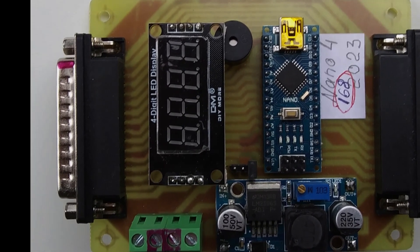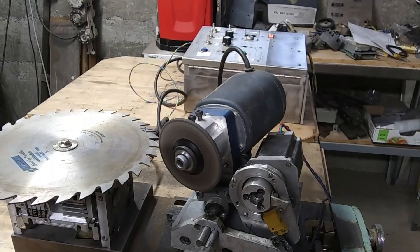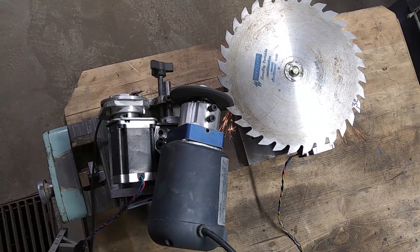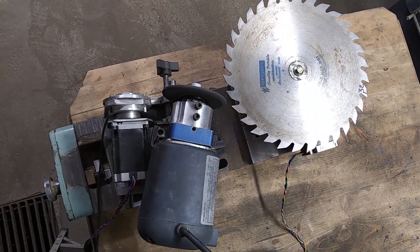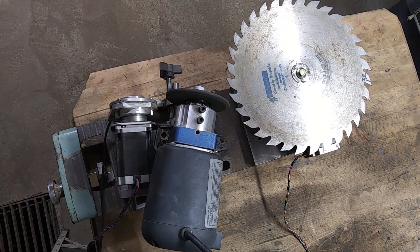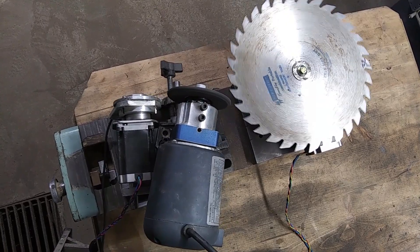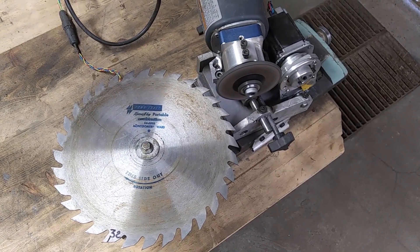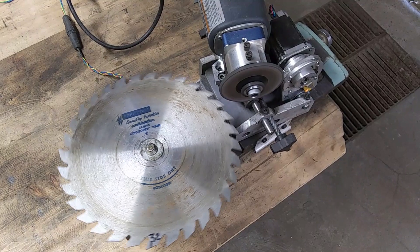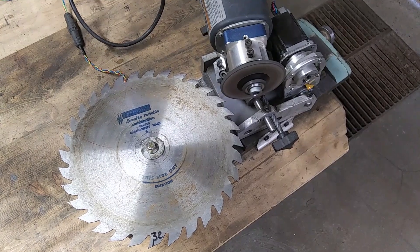The sensor sends signals to the microcontroller and turns on a visible light for the operator. In order to reduce expenditures related to consumption of the grinding wheels, we decided to incline the grinding wheel plane with respect to the vector of its actual movement — about 10 degrees. That allows the process of grinding to be performed with just the tip of the wheel, meaning a point contact versus a classic line contact. This method not only makes dressing of the wheel unnecessary, but also allows for the usage of narrow disc wheels, which fall into the least expensive category of cut-off wheels. Note that those wheels are widely available, monolithic, and shatterproof, and they maintain grinding capability not only at the periphery but through their entire structure.